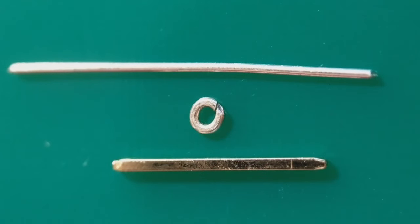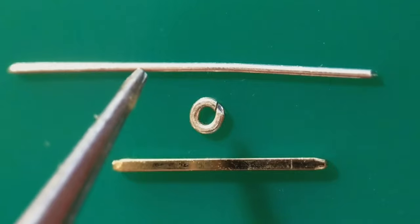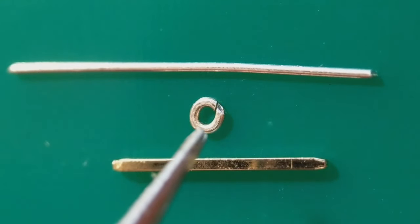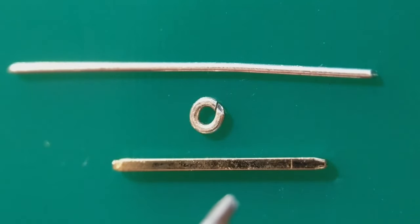So let's get started with fixing the first missing pad. I'm going to put a wire wrap around it. I've got an old resistor lead that I didn't need — I've literally cut that off and wrapped it around a spare pin I had, but you could just wrap it around the end of your tweezers or whatever is the size you need. I've ended up with a nice circle, a nice butted joint, and it's formed a good size — pre-measured to fit the missing pad.